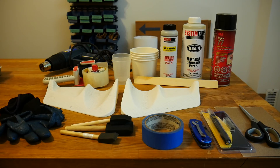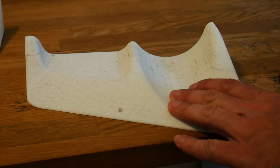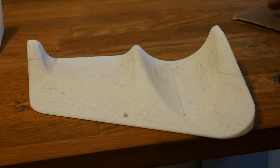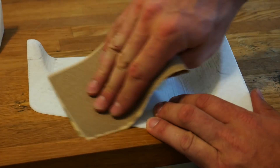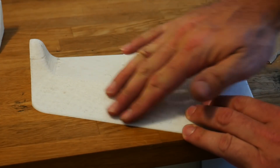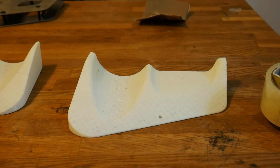The carbon fiber fabric itself is not pictured. Now we're gonna take our 3D printed part, or any part we're gonna be skinning, and hit it with some 200 grit sandpaper. This is really important to take down the high spots on the part, especially for 3D printed parts where the print head may have left over some excess plastic.